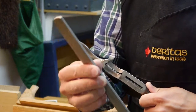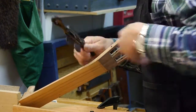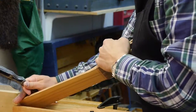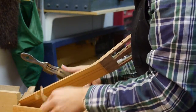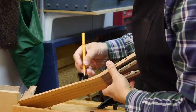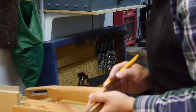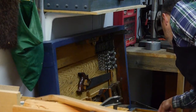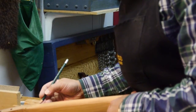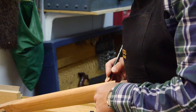I also have a rasp — I'll just use the file, I don't need the rasp. Basically I'm just bracing this against my chest, pushing the other end down to hold it still. Then I take the spokeshave using the concave rounded area and just pull it. Lest you think this is a slow process — when I did the banjo, I found out much too quickly, much to my dismay, that I had cut too much off of the neck. It had a little dip in it, and that was bad. So what I'm going to do on this one is draw a little line right here on the edge, and I can carve down to that line.